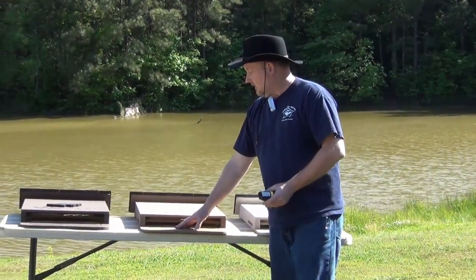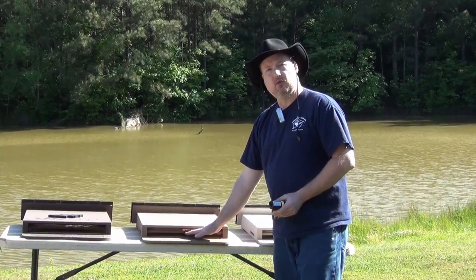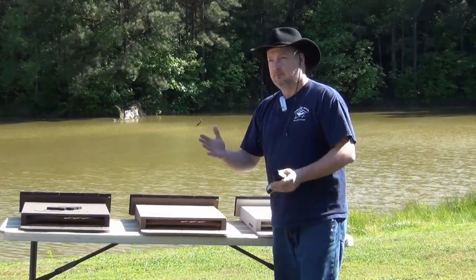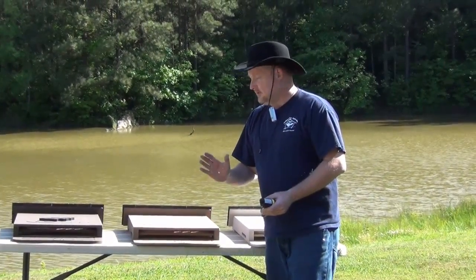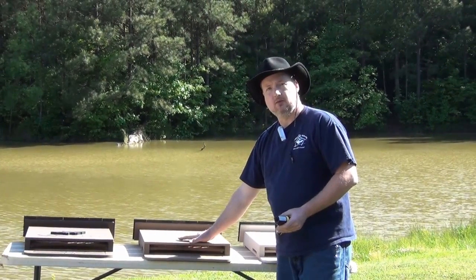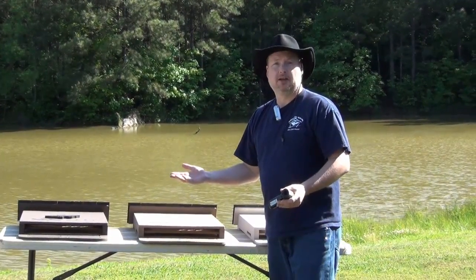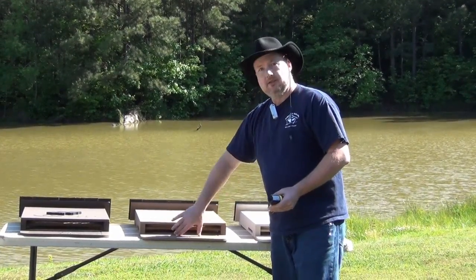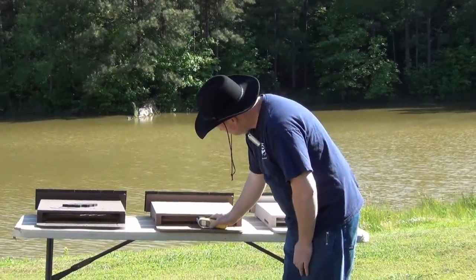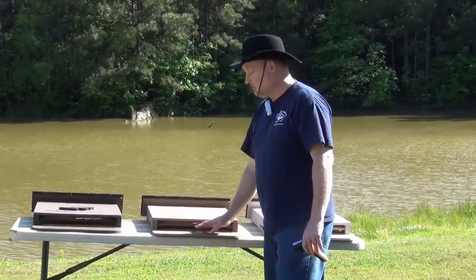Now if my guess is right, here in Georgia we should be seeing about 85 to 90 degrees somewhere in this house at this point during the day. Remember the ambient temperature — the temperature of the air outside — doesn't have as much to do with the inside temperature of the house because of the radiant heat we're getting off of the sun. This sun is just about as bright as it is during an August 98-degree afternoon. So the radiant heat is getting through and heating up the inside. So let's see where that's at for this house.